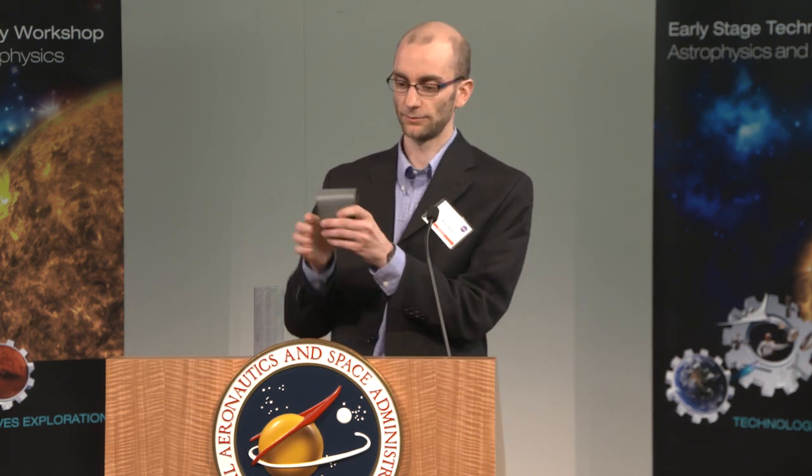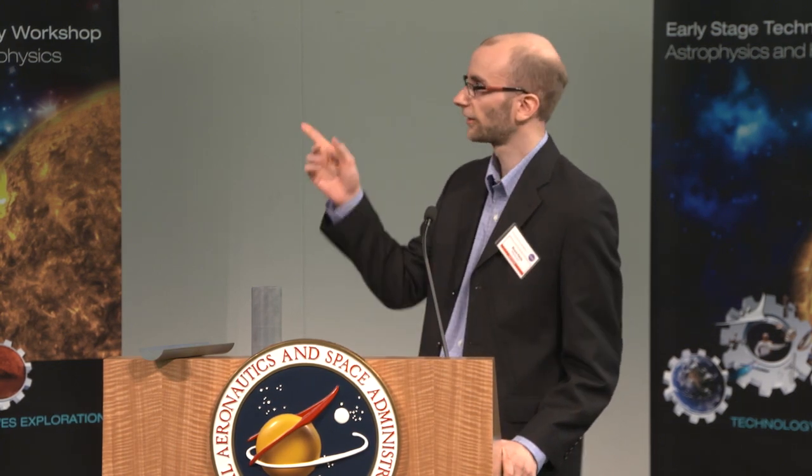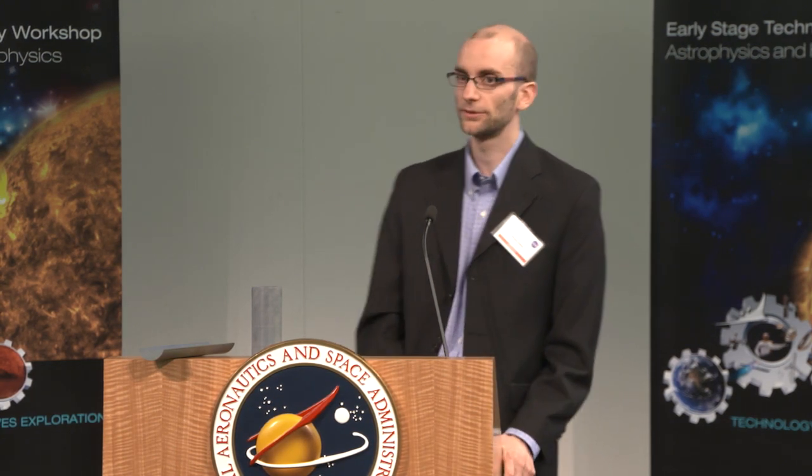Our unique aspect is that we're building them out of composites, so we can take this and we can really cinch it down to just an incredible bending radius, and there's no deformation. You can also backbend them to quite the same scale, and it's just going to bounce right back. It's all about using the proper materials, proper matrix, the epoxy resin that holds it all together, that makes that magic happen.